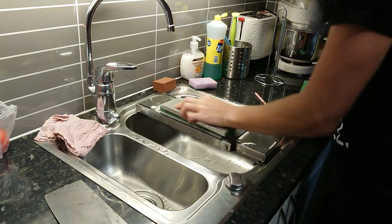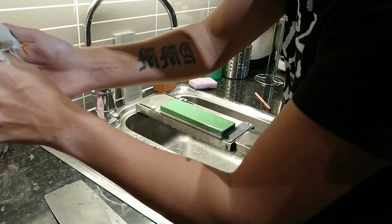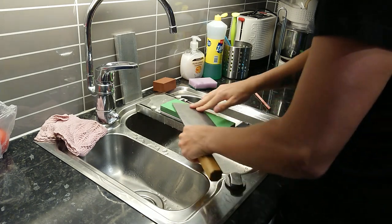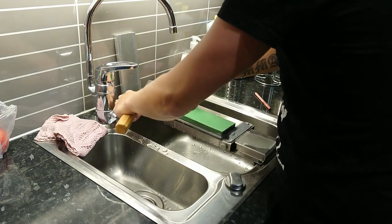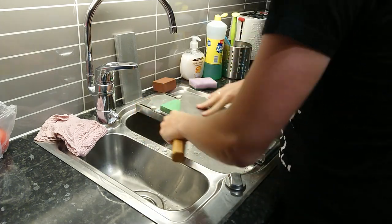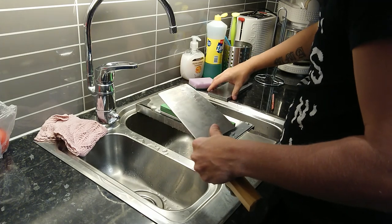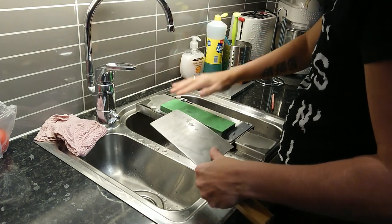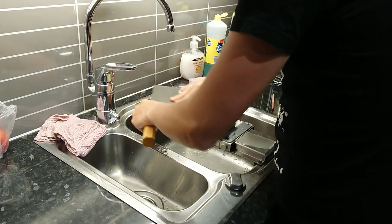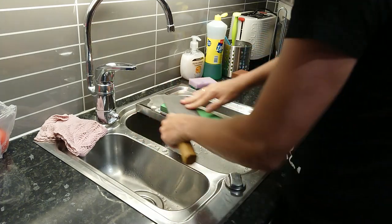And this was already flat, so I'm just gonna start working. Just wiping so I've got dry hands. And I'm sharpening this very low, maybe a 5 to 8 degree angle. Hit my edge into it. A little more water. And this feels incredible on the stone. So crisp, so nice. It tells me a lot about the heat treatment, if it's hard enough, when I put it on the stone.